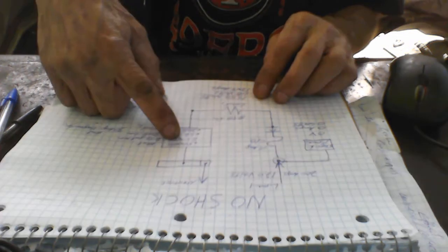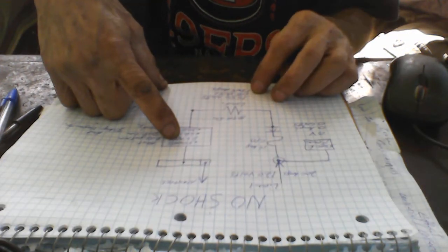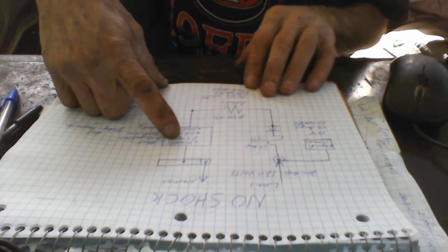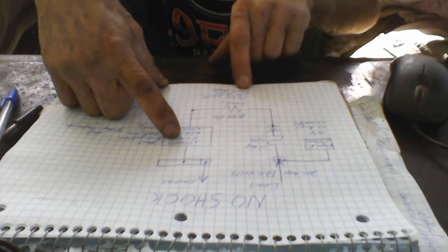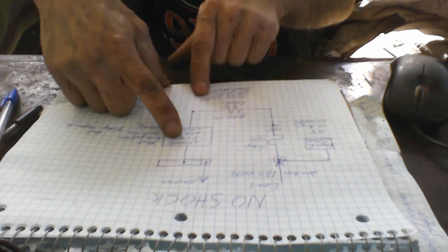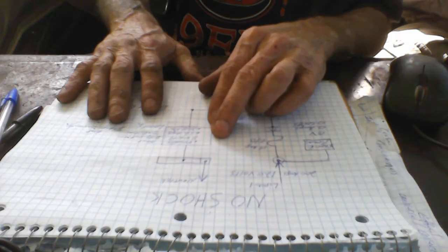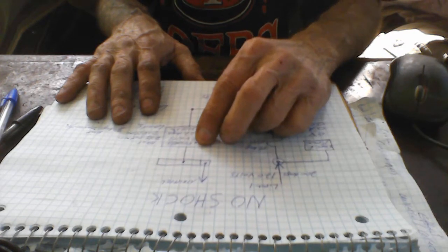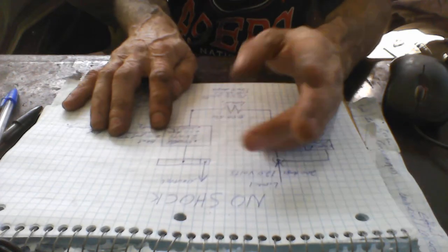With this circuit in here, under 120 volts coming in, it draws 118 volts. 118 volts is dropped across the line, and 13.414 volts is drawn through the load. So with that, the heat dissipation device draws 0.44 watts of power, which is just a little under half a watt of power.